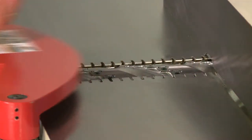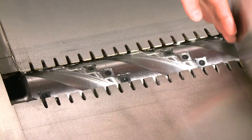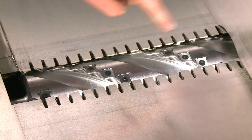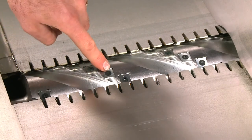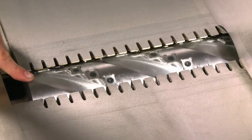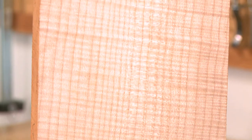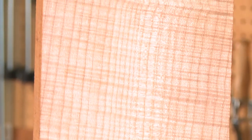The cutter head on the G0706 is a spiral cutter head that is 12 inches by 3 and 3/4 inches. It uses 60 four-sided solid carbide inserts located in four spiral rows, with each cutter overlapping the one before it. These are quieter running than traditional cutter heads, dramatically reducing tear-out in figured woods and leaving a glassy smooth finish that is second to none.